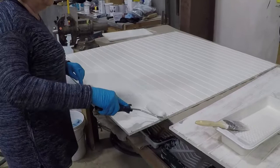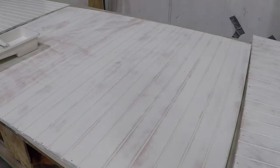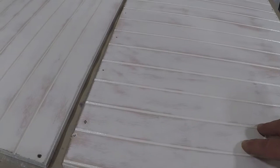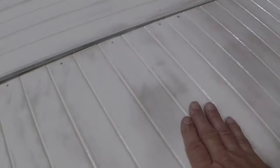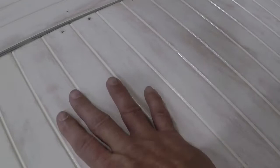Rosie's getting one of the first of the final two coats on the ceiling panels. We've gone over it a couple times — we're going to do it one last time, sorry if it's too much detail. So we did a coat on the back, an aluminum oxide coat on the edge, then two coats on the front. We thought we'd do a light sand with 220 before top coats, but we were quickly corrected by the expert painters here, who said no — sand with 120 grit, almost sanding the paint away. Those first two coats work more like a sealer, and if you could feel it on the video, it feels like glass.